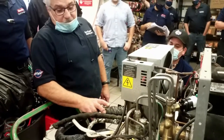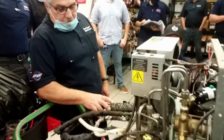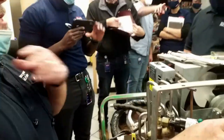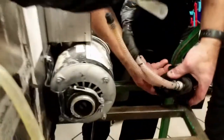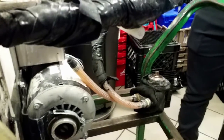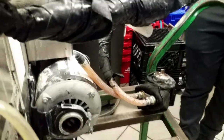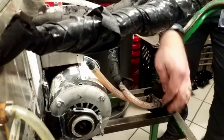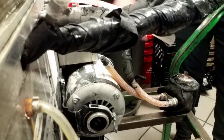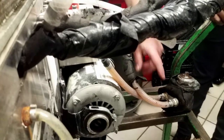That's all I got on the chiller. I know that. Now you've gone through the trouble of depressurizing this system. You're going to have to take these stainless steel fittings out of here. So you're going to cut that tubing off. With the Oetiker tool, you've got to cut these clamps off. Get the tubing off. Now you've got to take these fittings out.